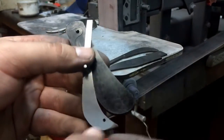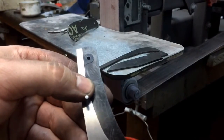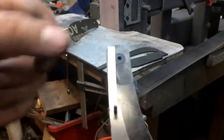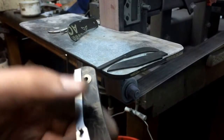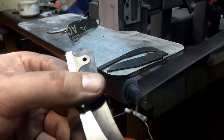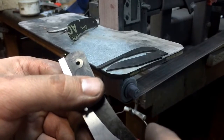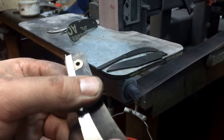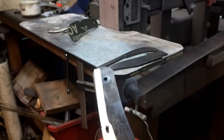You can see now, hopefully, when I drill this bottom center hole and line everything up, I'm actually going to have just a nice natural forward cant of the spring. That is why we set things up the way we did initially when I was drawing out the templates — I intentionally kicked the spring back about a sixteenth of an inch or so. That way, when I got to this point and lined all my holes up and centered this hole down here, my spring would be naturally forward, and that's where we're going to get our tension from.